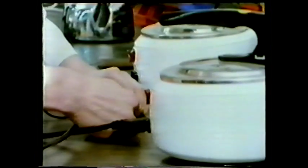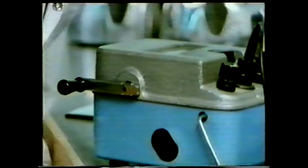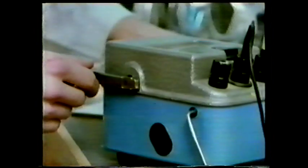The new product was put through a number of trials. The technician is testing the kettle for its insulation resistance, one of a number of tests insisted on by the British Electrical Approval Board. As part of the endurance trials, full kettles were boiled 50,000 times.